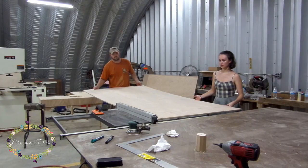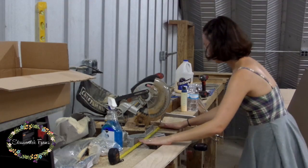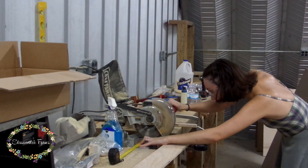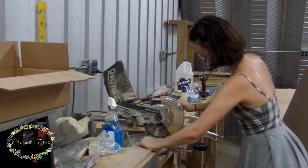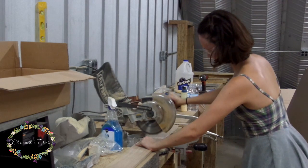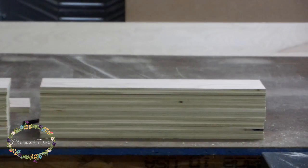Charlie helped me cut some strips from half-inch plywood so I could start working on the drawers. I set up a stop block and measured and checked and measured and rechecked to cut the strips down to size. Once that was done, I had all the drawer fronts and backs as well as the lengths — all of this out of half-inch oak veneer plywood.